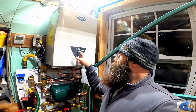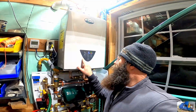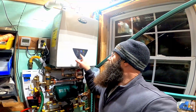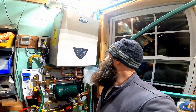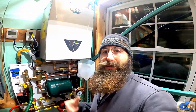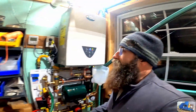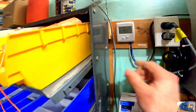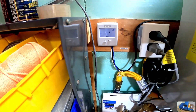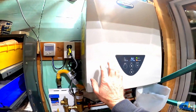The flow display is showing inlet temperature 56 degrees coming in, outlet temperature 106 degrees, and flow at 1.5 gallons per minute. We got all the valves for the manifold completely open. The thermostat is set at 45 degrees, current room temperature is 41 with a 36-degree floor temp. Flow is floating around 1.4 to 1.5 gallons per minute. We're going to let this thing run and come back.